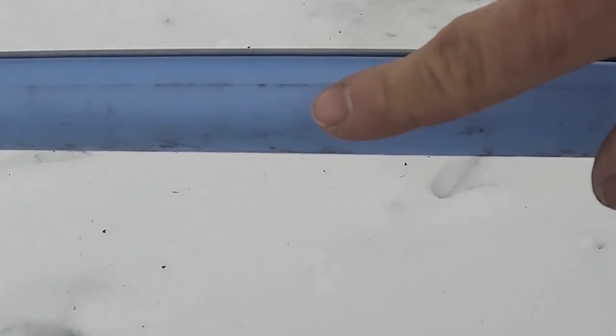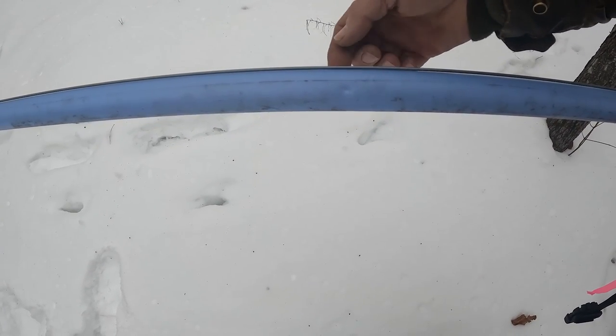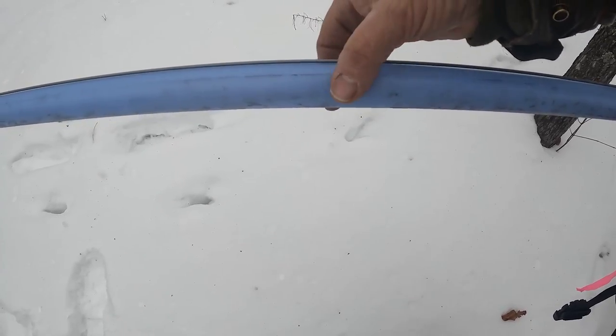Look really close — you can't hear it, but with that listening device you can. There's a bite on both sides, actually. We're going to tape this one up and then keep on moving. One tough thing that happens up here on the mountain is I get hot really quick, especially walking uphill — it's a constant battle of stay warm, stay dry. I've been in this area twice in the last week and I could hear the first two leaks, but this one I couldn't hear. So I'm really glad I had this parabolic microphone — it works really well.